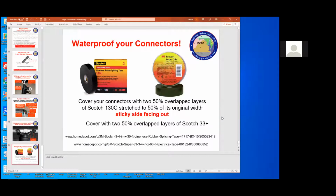Oh, and Rich, I didn't answer another one of your questions. You implied, maybe you didn't quite ask a direct question, is where should you put the stack match? Well, the absolute ideal place to put it from an electrical point of view is halfway between the two antennas. But I'll guarantee you that when you most want to use that array, somehow you will wind up having hot switched that stack match and it won't be working. And you won't be able to use it.